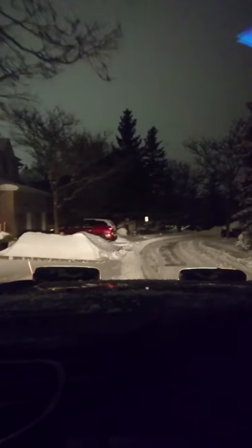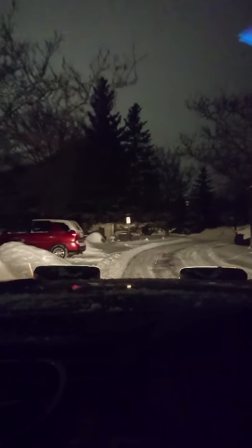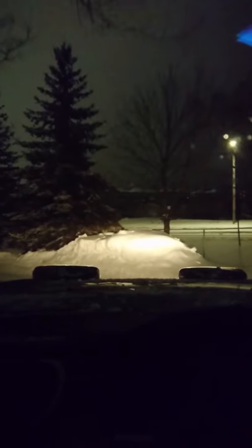So I'm going a little slower talking, backing out onto the street. I'm one of those guys who can't chew bubblegum and walk. So now what I want to do here is get this curb looking good. So I'll open my right wing up and I'll start to follow the curb. Well, it's a little bit deep yet, I think, to get it right to the curb. So I'll stay about 6 inches off the curb and you'll see a little bit of a windrow up here, but when I come back down that in a minute, it'll pull all the snow away from it. And here, I'll switch to a dog leg again, so I can take it around here. Excuse me. And I can run it right down and to the back there again.